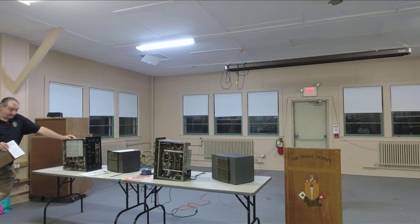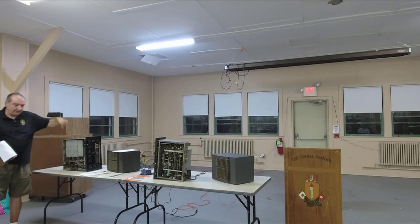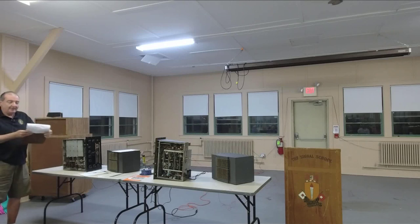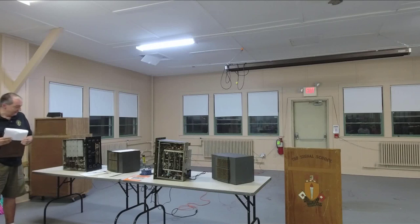That says a lot. The very first one I got, at the Sussex Hamfest in the early 90s, was an AR-88. Water had dripped into a particular spot and ruined all the pins on the 6SG7, which turned green. I took it out, cleaned the socket, plugged in another 6SG7, and off it went. Made my day.